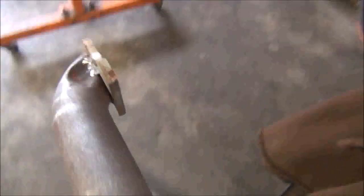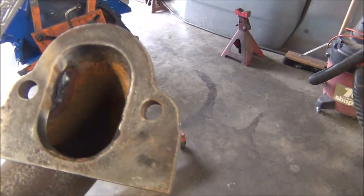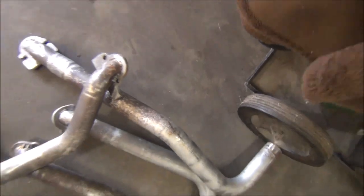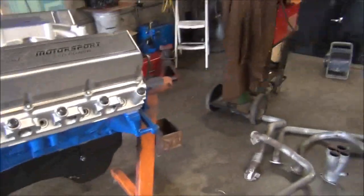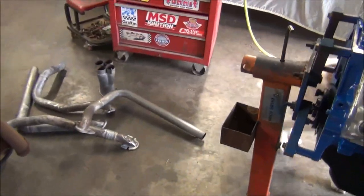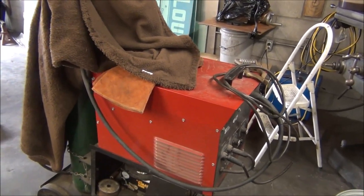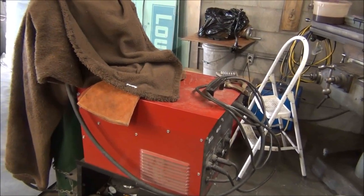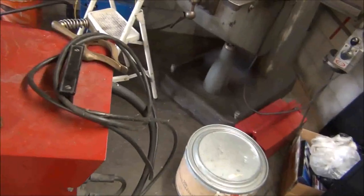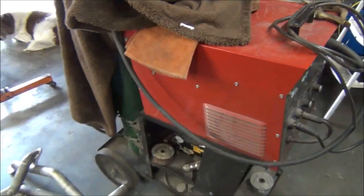There was a crack right here where it's hard to get to. I need to remake these headers eventually — if I were to make some headers the proper way I could probably get a little more horsepower out of this thing. But we're not going to do that now; they've worked for all these years and the car ran pretty good, so we'll use them for now until I get a chance to make them out of stainless. I want to buy a TIG welder and start doing some TIG welding, because my old MIG welder gets the job done but I just can't do a decent-looking weld anymore. I've replaced the liner, tried small diameter wire, checked everything, and it just wants to hang in that liner every now and then — any slight bend in the cable and it wants to hang, and you can't get a good steady smooth weld.